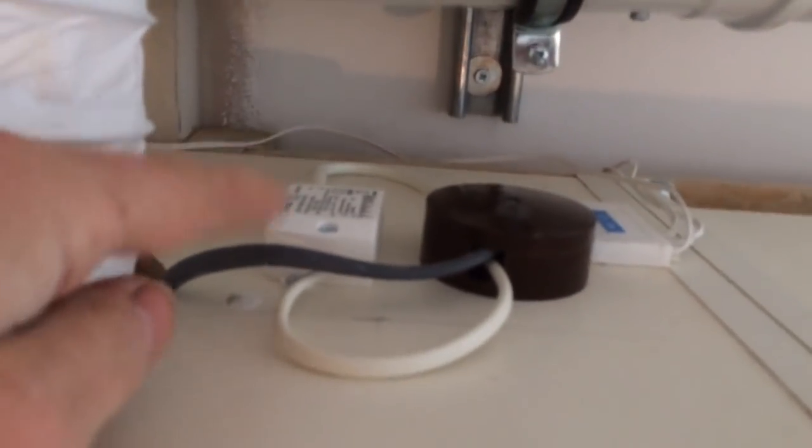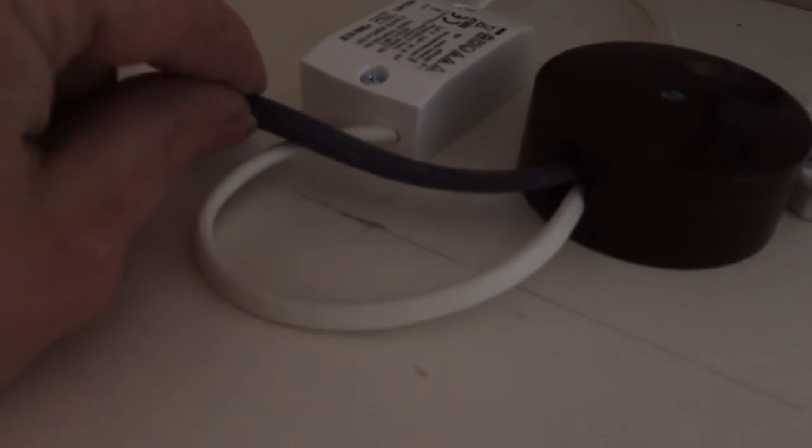While I'm here, this is the little under cupboard light setup - so you've got your little transformer there. These are good for 6 watts. Those little LEDs are 1.8 watts so you can put three off of here, plug them here. Little junction box and then the little light and cable coming in.